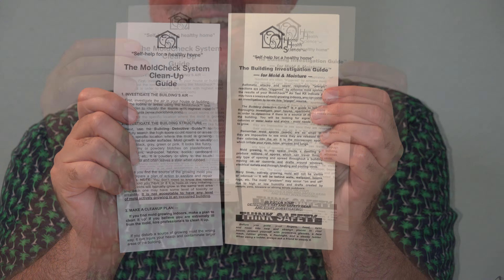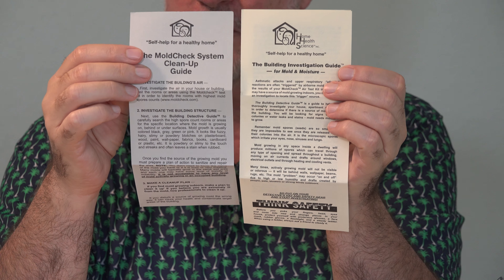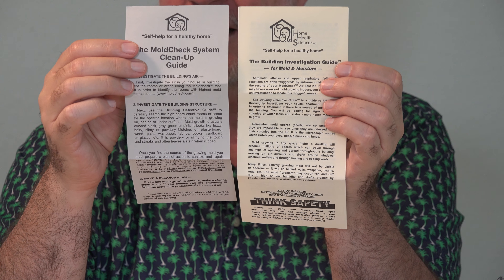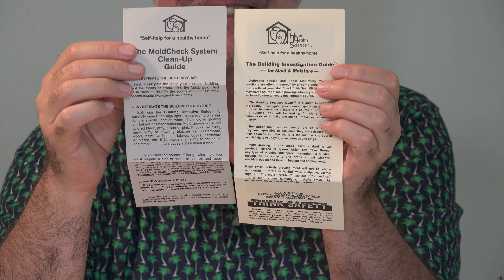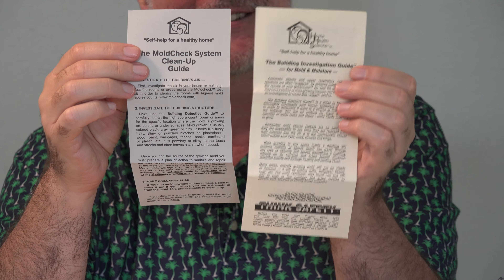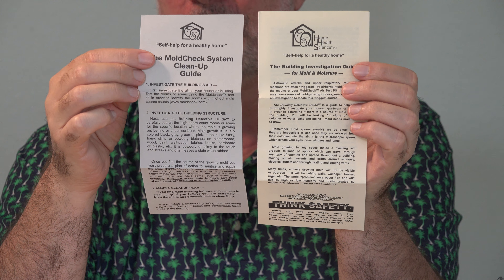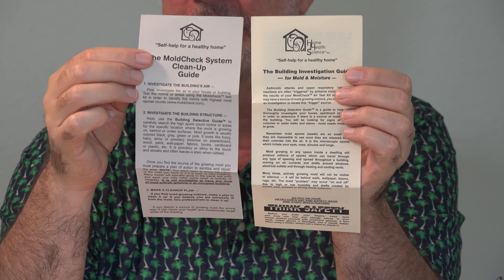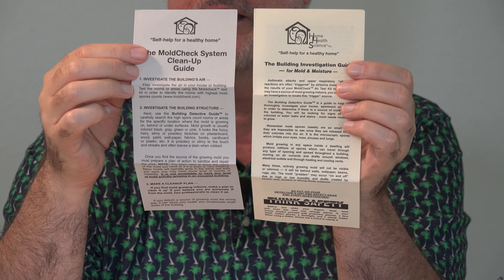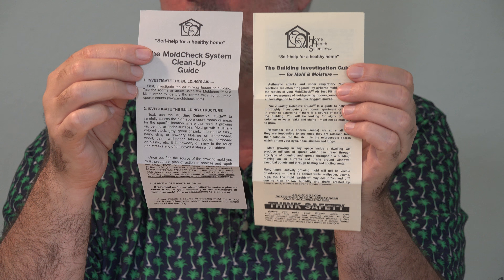They also include a building investigator guide to find out where the mold is coming from. My favorite step was to go up into your attic with a flashlight, hold onto a beam or support yourself securely, turn the flashlight off, and look up. Do you see light coming through the ceiling? That may be a hole in the roof — you need to have that fixed. The guide also lists typical steps for cleaning up mold: things you have to absolutely get rid of, and other things that can be salvaged with a bleach-water mixture or other chemical.